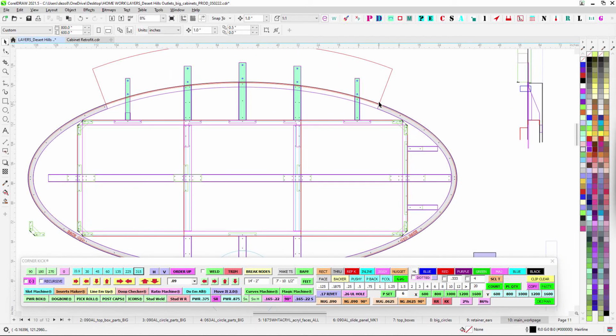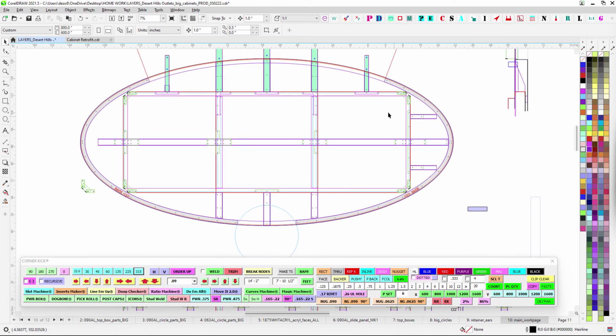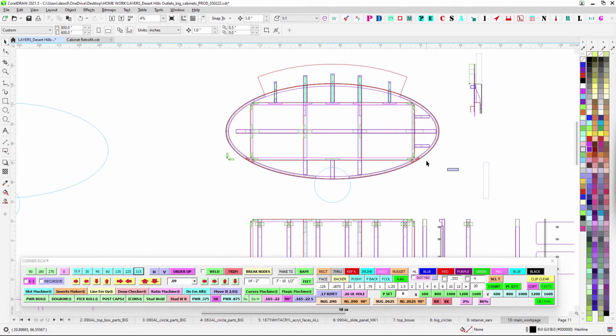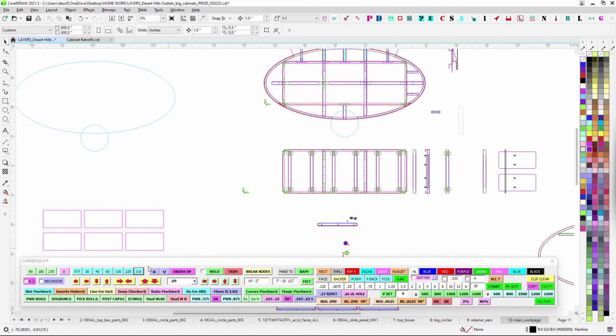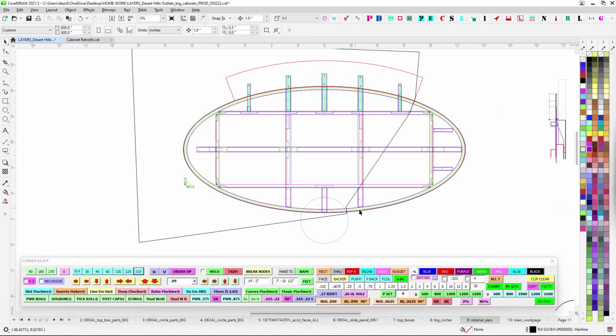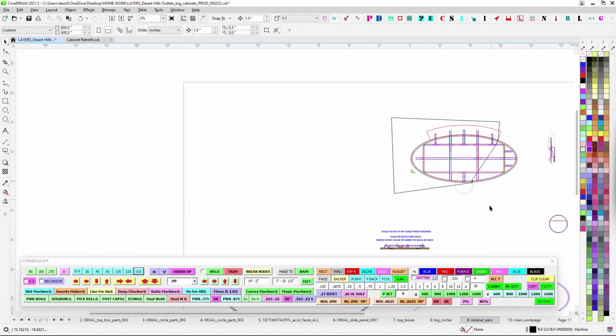Plus, also, even when you've tacked it, people are going to use this as a handle. It can pop off, and oh boy. So, to make it easier on you guys as well, I figured what I would do is make ears. So I went ahead and chopped off that retainer size, and I made it 2 inches deep.